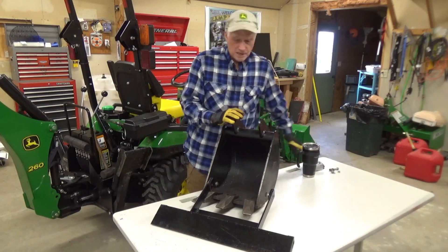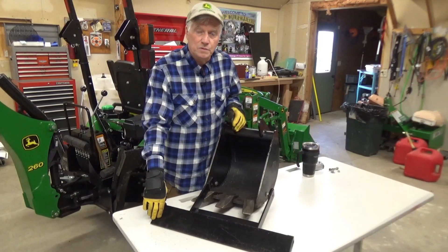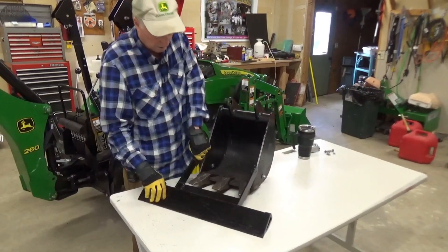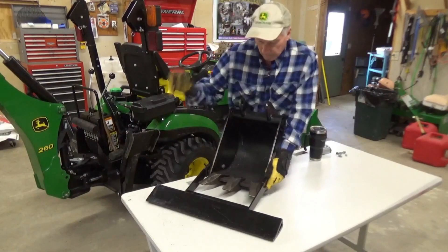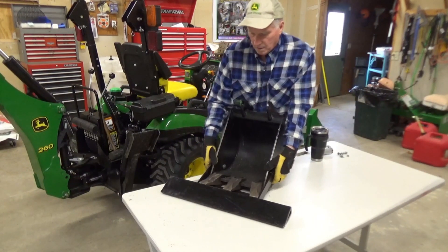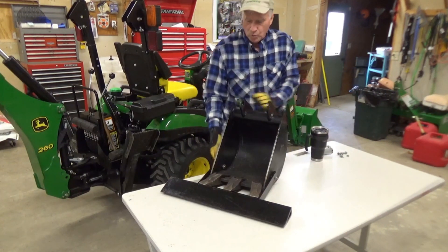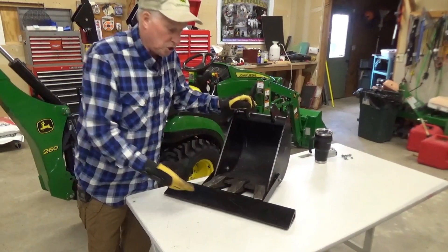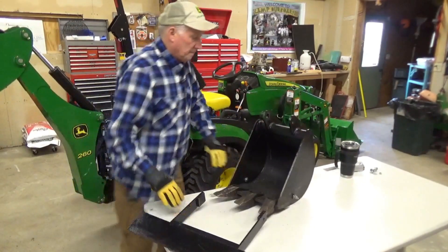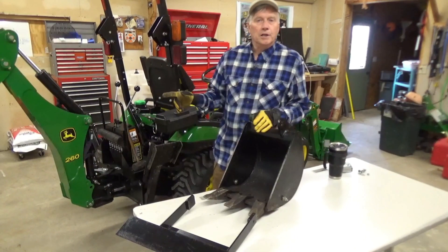So Kenny and I have been busy as I said. Our new blade is 24 inches and we'll go through this in a little more detail so you can build one of these for yourself. It fits on the 12 inch bucket. It goes in a little bit deeper to be easier when it's on the hoe, and these bolts — nuts and bolts — hold it on here. And likewise if I want to change from a scraping action to something more aggressive, it'll come right off and then you're all ready for the next project.